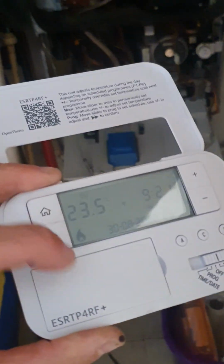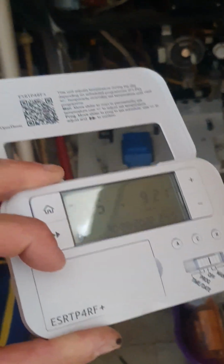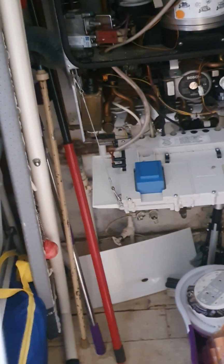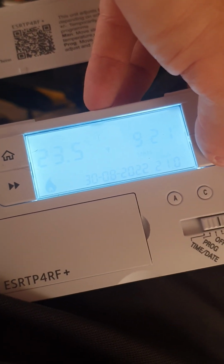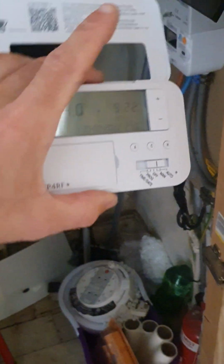If there's a problem with the thermostat, it's run out of batteries or it's broken, as you can see, the boiler is now about to fire, and it's just fired. So now if we put the temperature back down past the temperature in the room, the flame symbol will go off and the boiler will stop firing, and that red light. So the red light essentially means the boiler's firing via the thermostat. If the thermostat's faulty or the batteries have run out, you can override it, and it's very clear how to override it: just press manual, and that will then tell the boiler to fire. To cancel that, you just press it again. So ideally, if you've got a green light on, then this is not going to be working. So don't touch anything on there unless you have a problem.